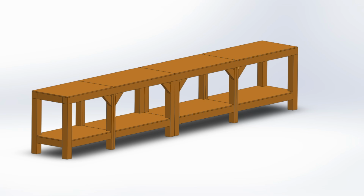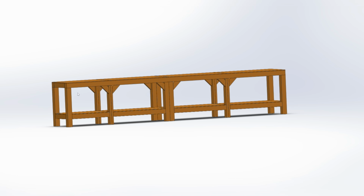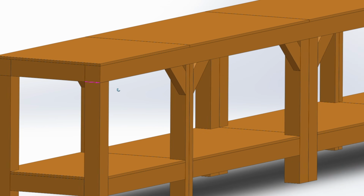I'm going to do a third design that's not really the best way to make a workbench, but I want the side rails to be continuous down the whole length. That way I'll have a mostly straight surface the whole distance. It's wood, so it won't be perfect, but I should be able to shim the feet to get it flat enough without any discontinuities in the wood.